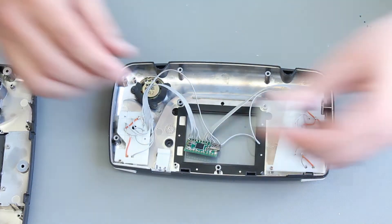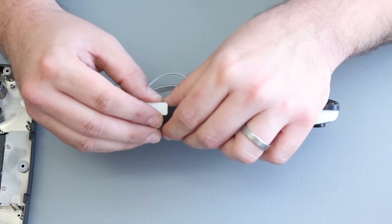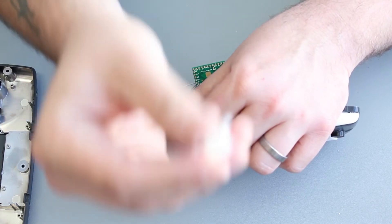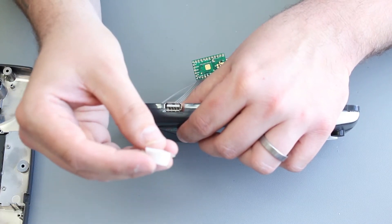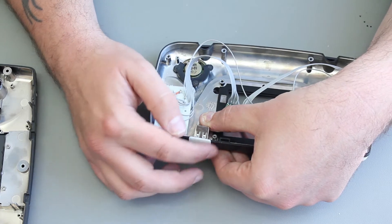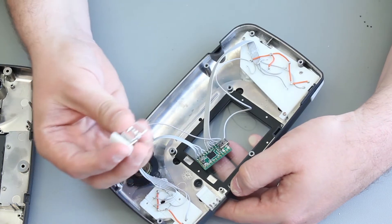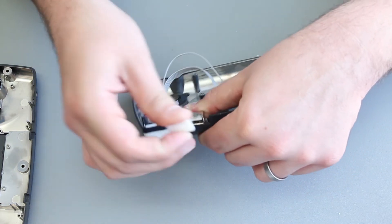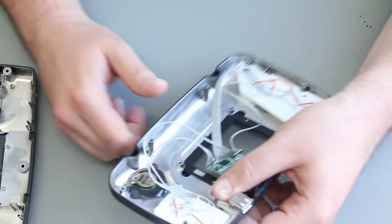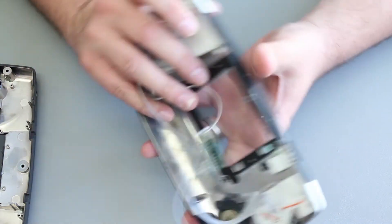The other thing I've physically done is there's a USB connector here that's going to go where the Gamelink connector goes, and it will go under a little cover. I found an interim cover on Thingiverse — if you search for 'USB cover' you get this device which is just a plate with a bit sticking out. I've also stuck a little shelf inside the Game Gear that the USB connector sits on, so the connector is held at the right position. When you pull the cover off, there's the USB right there. I'm pretty happy with that — I've seen other Game Gear Raspberry Pis where they've hacked the case to pieces and I really want to avoid doing that.